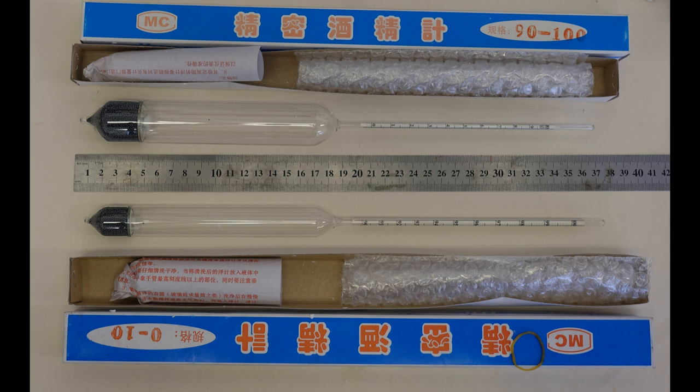This, and the slow output of a continuous still, means that it takes 2 to 3 hours to fill the parrot. So not only is spirit production slow, but so is the response of the parrot. But we're only checking on the still every few hours, so that isn't such a problem. The large diameter of the parrot, and the many hours for which the still operates, brings another problem: evaporation losses of alcohol from the surface of spirit exposed to air at the top of the parrot. I've calculated that these amount to several percent of the alcohol produced.